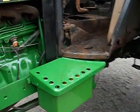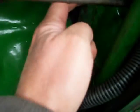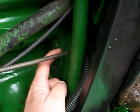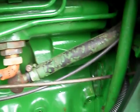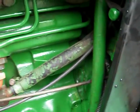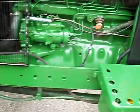The other tool, that specialty tool that they have, actually goes in this little inspection hole here. It's a plastic cover. It gives you access to the ring gear, and I believe it must be some type of a gear where you can put a ratchet or something. That allows you to rotate the engine, which further aids in aligning the clutch.